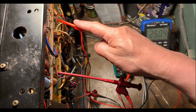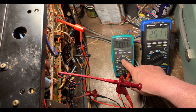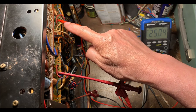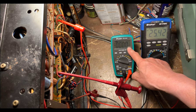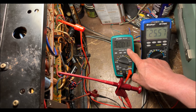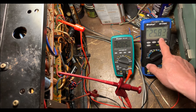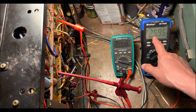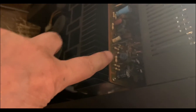After I hooked up the output to the meter — this is the left channel and this is the right channel — I adjusted the left channel already. This is close to 0.1 millivolts, almost zero volts. And this side is still 25.6 millivolts. So I can adjust this right here to make it even lower. This is VR02 here, so I'm going to adjust this point here.